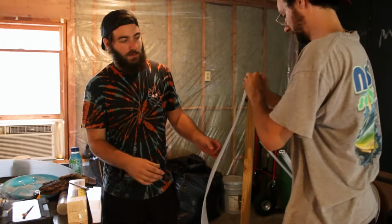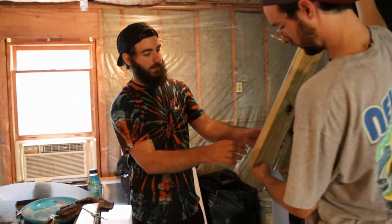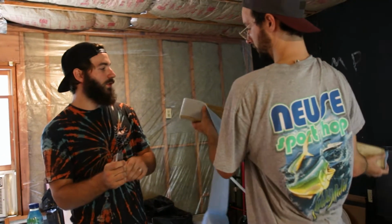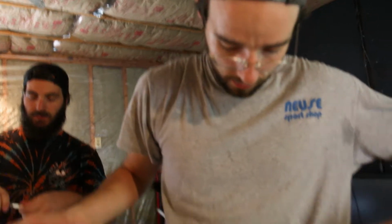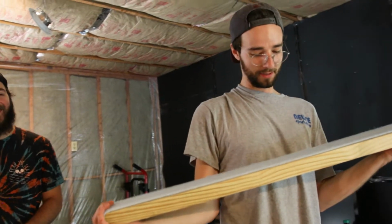We're wrapping the bottom treated plate with this foam sill. And it kind of, do you mind? Yep. Thanks. It kind of, when you screw it in, when you seal it in, it'll create a kind of weatherproof layer. And so weather is proofed out. This goes on the ground and it squeezes up against the ground, makes that noise. Yeah. And it makes that weather seal.